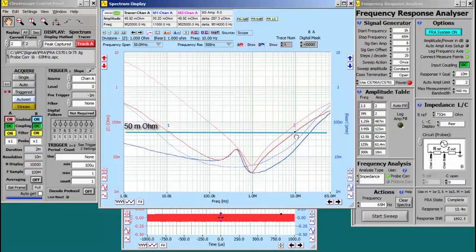So we've widened the range over which the impedance is less than 50 milliohms by quite a lot. Note the anti-resonant peak at 500 kilohertz. The impedance is still pretty low, less than 20 milliohms, so below our 50 milliohm limit, but it can become quite high. Avoid these anti-resonances by making sure your capacitors are quite different in value. Anyway, we've increased the bandwidth over which the impedance is low by quite a bit, at least a decade.